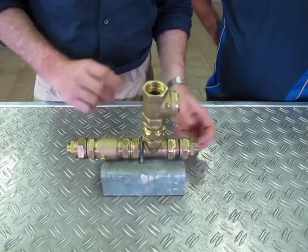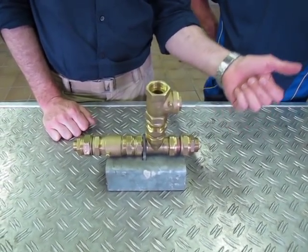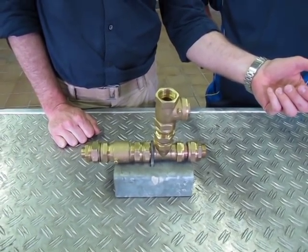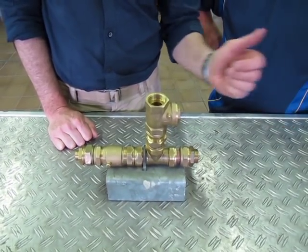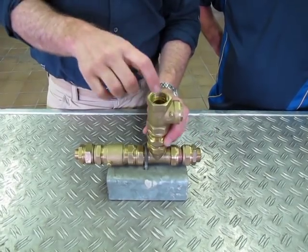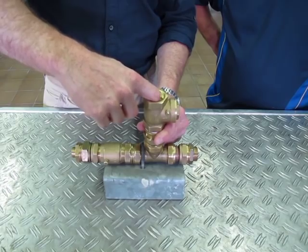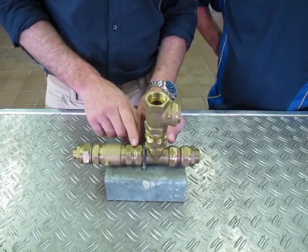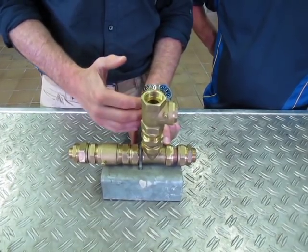What happens is the water feeds in through here. The water will be coming from a river upstream, coming from a pond or maybe even a spring at a higher level. It comes down here and starts to flow out through the flap valve. As it gains momentum it catches the flap, pulls it up and slams it shut. When it slams that flap valve shut, the water in here comes to a stop, which causes the pressure to rise.